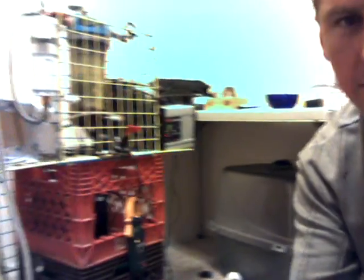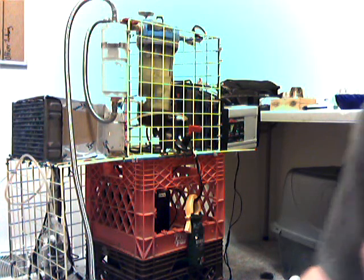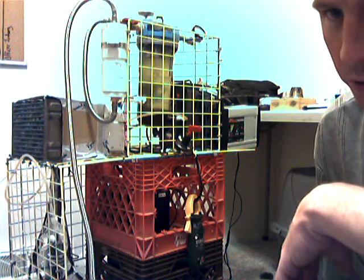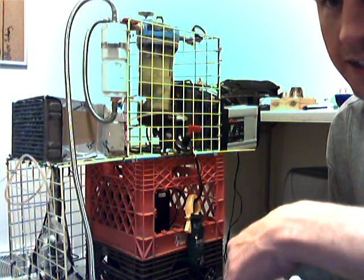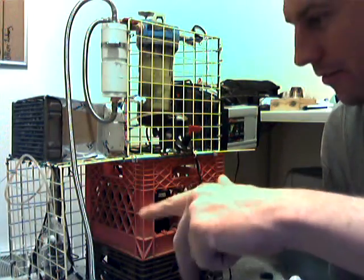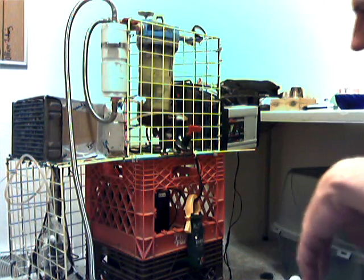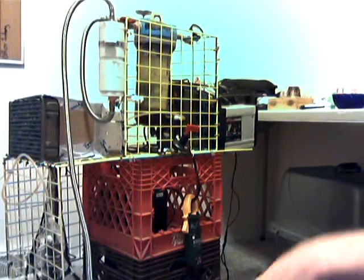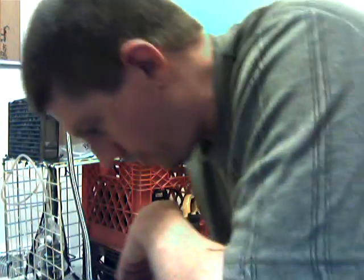As long as you're using a good electrolyte — which brings me to the next point: don't use baking soda, for several reasons. Some people use baking soda thinking it's a passive electrolyte that's not going to hurt you. Well, first, baking soda is converted into sodium hydroxide in the electrolysis process. Second, you're giving off carbon monoxide gas, which is deadly. Third, you're putting off a significant amount of carbon dioxide gas, which is useless if you're trying to burn flammable gas. It also destroys your electrodes. So don't use baking soda.